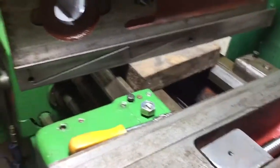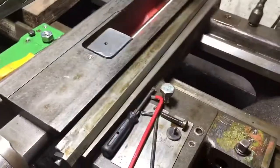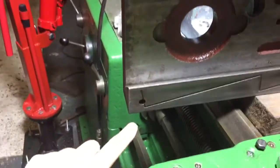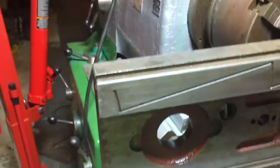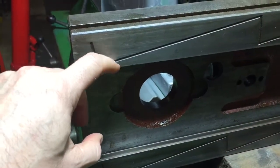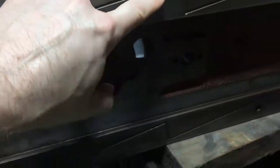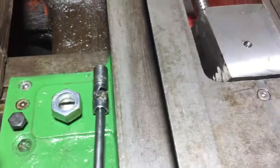It's starting to get clean and the mechanics continue. This part here is the cross slide and it lives on the saddle. We can see here it's quite rough at the edge where dirt's got into it — it's acted a bit like a horrible key job on your car, but it's not massively deep. Here it's quite flat and here it's caused a bit of damage, but it's going to be okay.